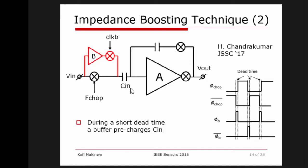So this is a really nice circuit because it gives you a high impedance over a very wide range of frequencies. In that positive feedback scheme I showed, you're kind of limited by the bandwidth of the amplifier itself, because at higher frequencies, it cannot feed back the right signal.